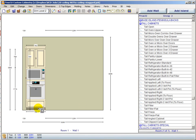And now I'm just going to fix the drawer that's showing a drawer front with cut down rails. I want a door anytime I do a tall cabinet like that. And just as soon as I drop a cabinet, I usually do the hardware to make sure I'm getting my hinging and making sure I'm getting everything like I want it. And don't forget those things.